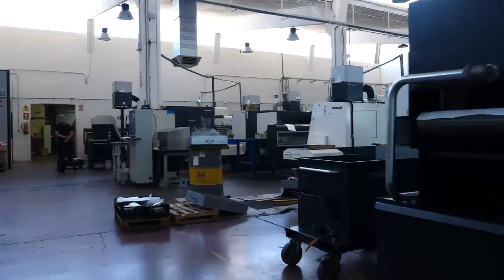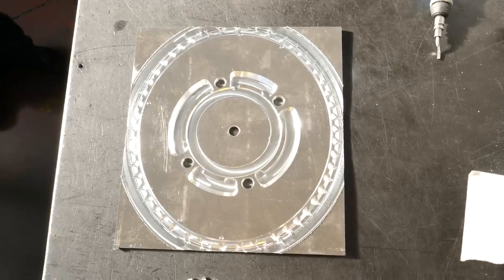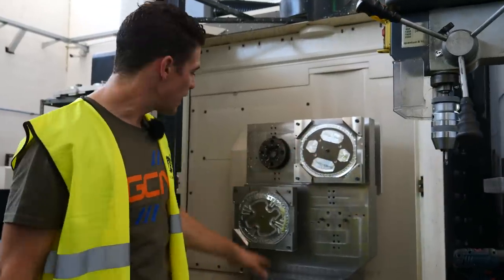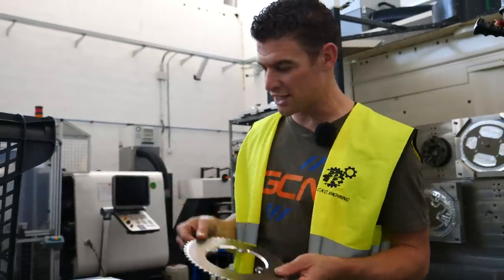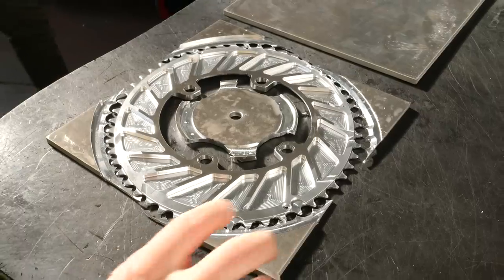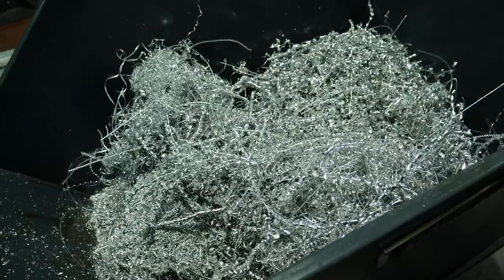Step two of the process happens in the DMC65H duoblock milling machine. My square sheet of aluminium enters the machine into a bespoke mount, and this machine manufactures two rings simultaneously. As the rings are not symmetrical, each side is produced individually — first side A, followed by side B — effectively doubling the speed and capacity of the manufacturing process. My square sheet metal now really is an aero Q-ring, which I find quite exciting. There's a brief quality control check here to ensure there are no rough edges left on the chainring and to verify that the teeth are of the correct profile, height, depth, and width. Worth mentioning: only around 20% of the total material that comes into the factory is used in the final product — the rest is recycled. There is zero waste in manufacturing a chainring.